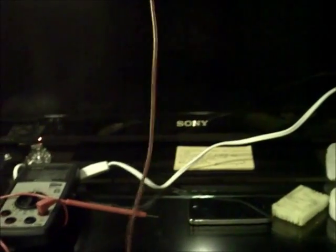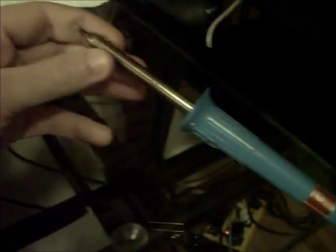After that, you really just have to go back to the antenna solder point and solder on a new length of wire. In this case I simply used speaker wire — nothing special, just a length of speaker wire. You're going to have fun soldering that tiny point, which is why a 15 watt soldering iron is a good thing to own — very helpful.